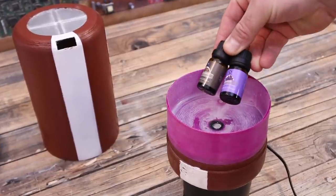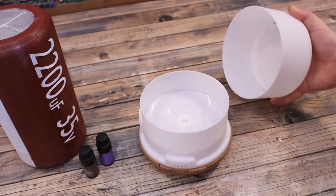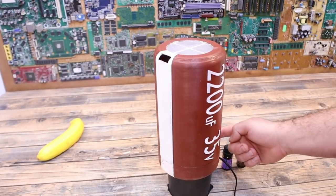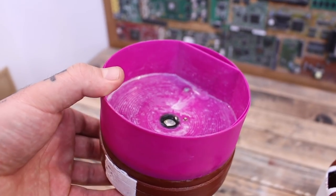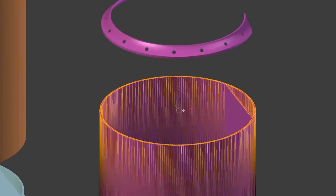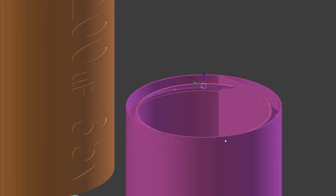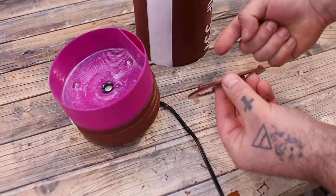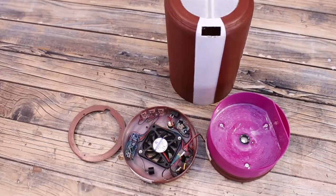The idea is to also add some perfume to the water and give a good smell to your home. I bought this mist generator a few years ago and it comes with all sorts of perfumes for the water. Just add a few drops and it will give a very nice odour to the water mist. So this project is very cool but also very useful. I had to change the design because the water container is too short and some water will get spilled out. So I should make this part a little bit taller. In the final design I've also made the container taller and added a skirt around it so any water spill will just go back inside. I also realized I made an error by placing the power jack below — it's too high so the legs won't be enough. It will be a lot better to have the power jack on the side together with the switch. You have all these changes below with the final design.